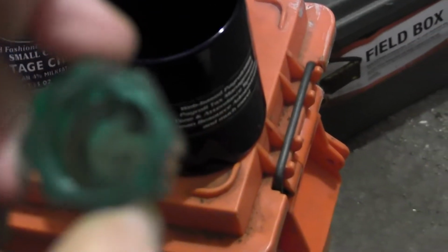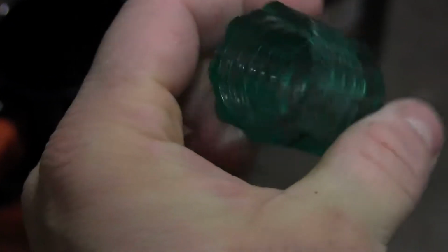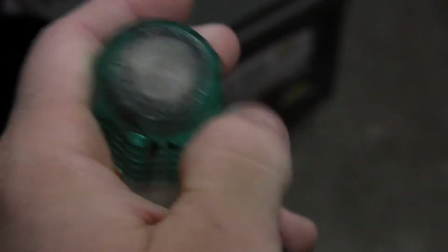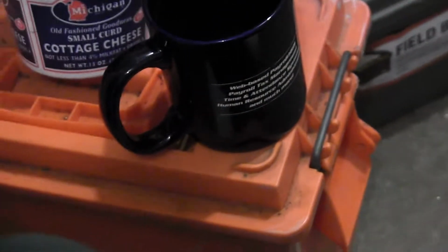So, got my Hornady bullet puller. I was pulling some rounds down, and I noticed that this cap has a hole in it with the regular 3-prong collet. I hate cameras. They don't know my subject matter. With the three-prong collet in there and the hole being open, it was letting powder loose, and I couldn't get an accurate measurement on some Nagant ammo. So I just took some hot glue, set this upside down on a table, and glued the inside of that. I touched my finger to it and burnt my finger, but I got what I wanted. And my pinky's pretty much all healed up by now.